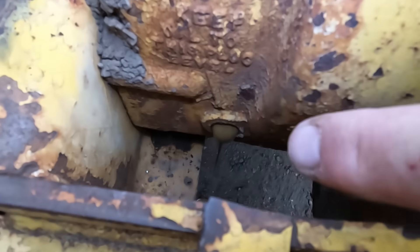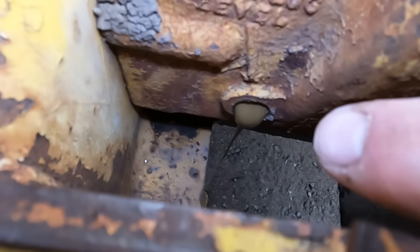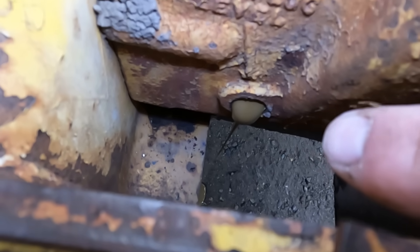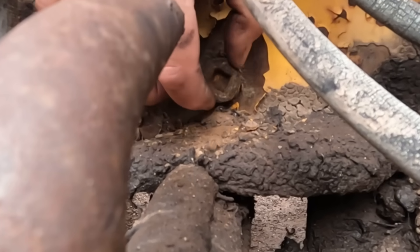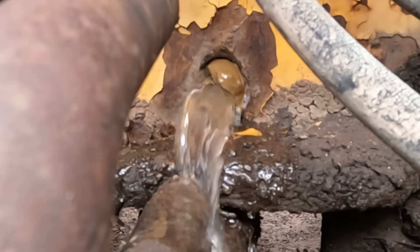After that I figured I'd check all the other fluids, like the transaxle. The oil wasn't supposed to be up that high and it was supposed to look like oil. Looks like we're draining this transaxle. Pulling out the transmission drain plug — this should be interesting. Oh, there's water. Lots of water.